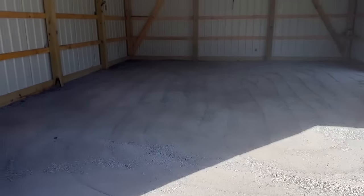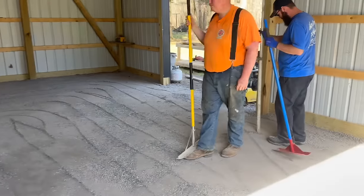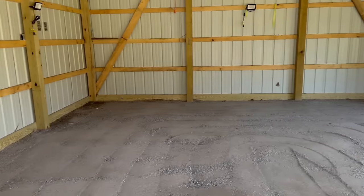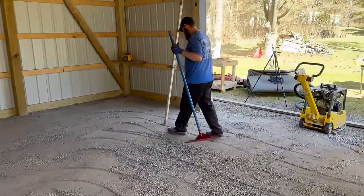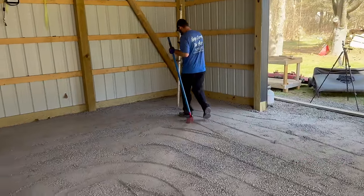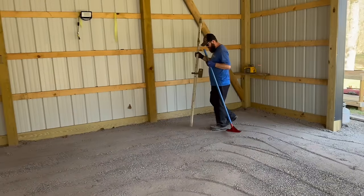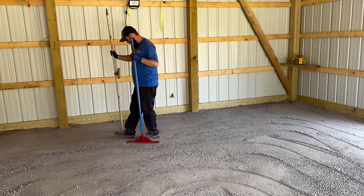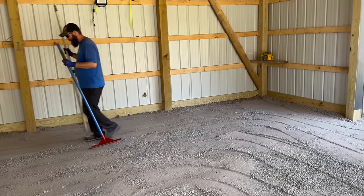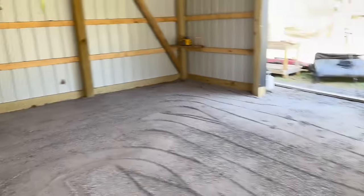So we just added a couple inches, guys, tamped it. Chris is checking, it's all still low, so we're gonna come in and do another lift. But we like to tamp it down in lifts. What's it all, like an inch low at least? Yeah. Well, this is set to 5.5. Or 5? Oh, 5? Okay. I got it. If we get it to this and tamp it again, we should be really good. Yep.